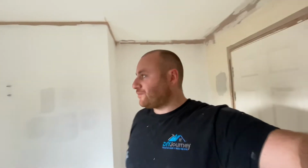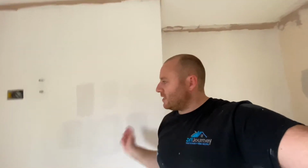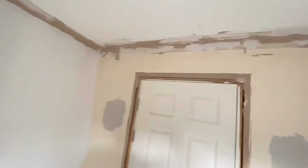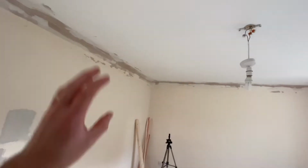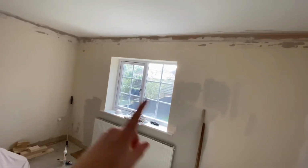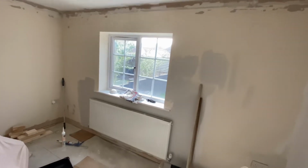And that's what we're going to do on the walls. So first, get the ceiling done white in the first coat. I'm going to go over this section where the test pots are, just to cover them up a bit more with the white, and then we're going to go around the room with the colour for the first coat. Now, I'm not going to go amazing with it. We've still got the coving to put up, and then I need to caulk round and the radiator needs to come back off again.